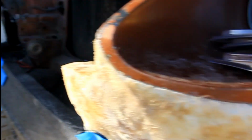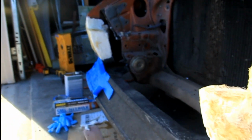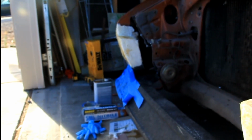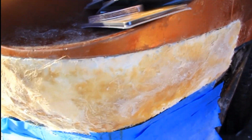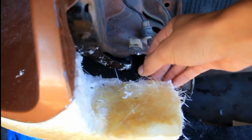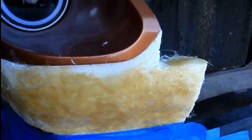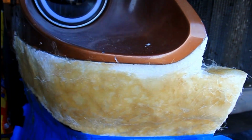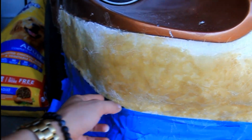After going back and checking both methods, the one that me and Zay both did, Zay's laid the fiberglass on there easier, but as far as the cleanup part of it goes, this is a little easier for me to clean up, because if you look with this, there's a lot of leftover fiberglass that wasn't touched with the resin. So not necessarily that the method worked bad, but we just didn't have enough paintbrushes and stuff like that to make sure that every piece of this was touched, because parts like this are going to be a pain when it comes to taking it off.